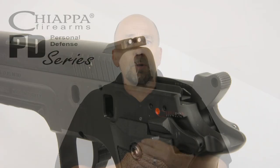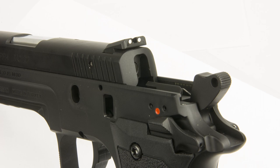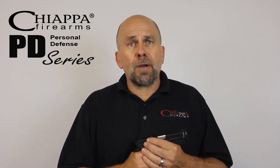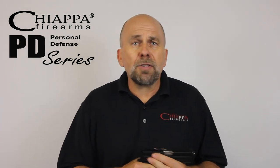to the recoil reduction. Speaking of recoil reduction, the Model 27 uses a reverse slide groove channel very similar to the CZ75 and the SIG P210. This allows the slides to ride on the inside of the frame rails instead of the outside. This design allows for a very tight slide-to-frame fit with a very efficient barrel lockup, with the slide being much lower than the typical configuration. The lower slide provides a lower bore axis, which equates to minimal muzzle flip and less felt recoil.